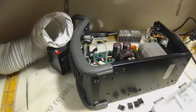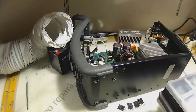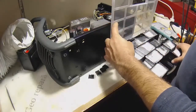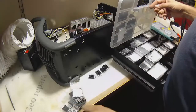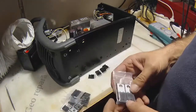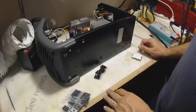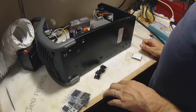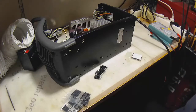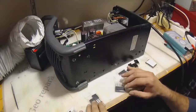I think I have some of those diodes — diode box here. These are 60APU04, that's 400 volts, but they have a bigger forward voltage so they will get hotter. So I would put the original ones — 60APU02.